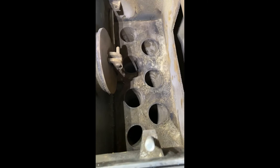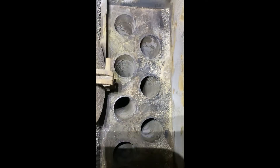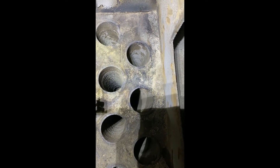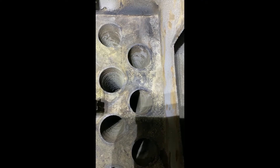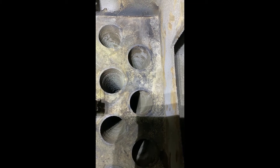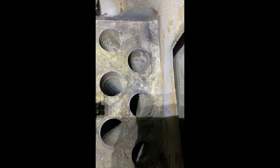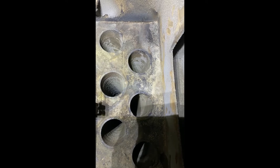We're back and have completely removed the mechanism that moves the turbulators up and down. You can see that even though I actuated those turbulators before removing them, there's still quite a bit of fly ash in the exchanger tubes, which prevents good heat transfer. I think it's a lot better to just remove the turbulators and the mechanism entirely and use a brush — it does a much better job of cleaning.